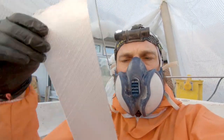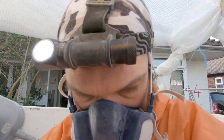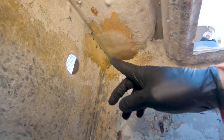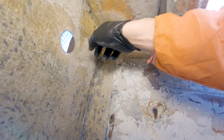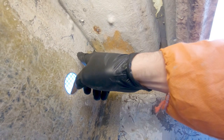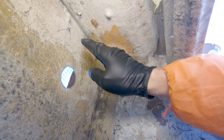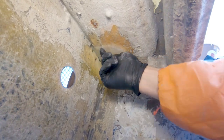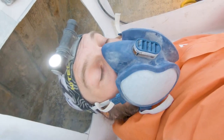So I got my tape. It's a 4-inch strip of glass fiber. And then we've got it down. So these are the tapes. You can see the repair going up over the top. And the deck is joined to the hull using these tapes here, which you've cut away to do the repair. So we'll just put these back in again. From underneath. Very good. Okay, it's done, I think.